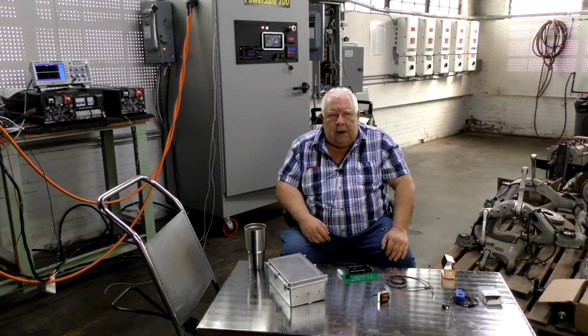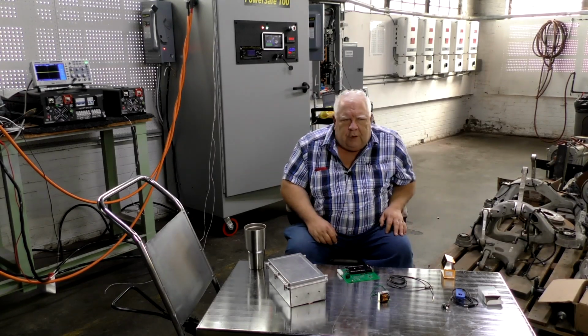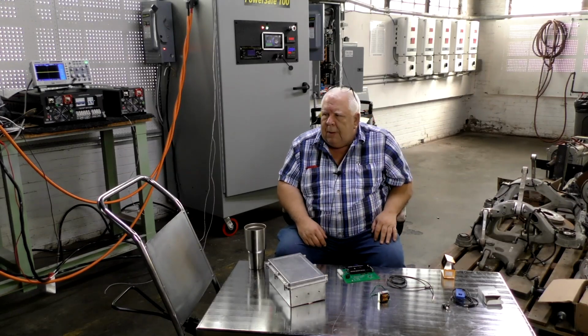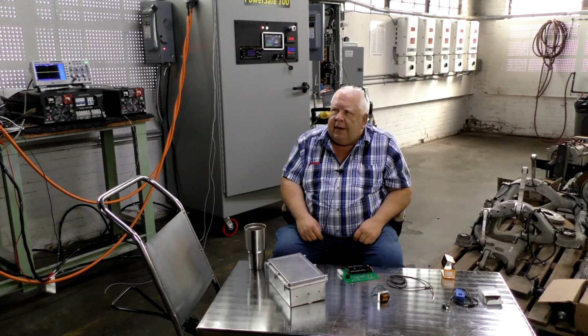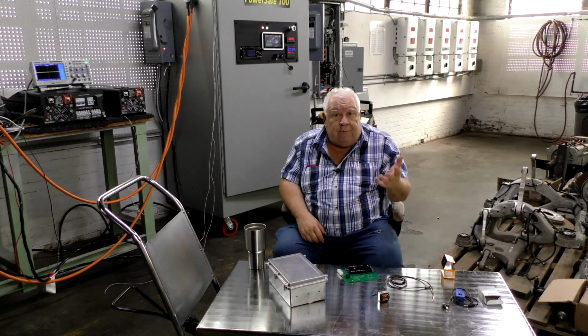Like DC power, if you multiplied your AC current by your AC voltage, you would think AC power. You don't exactly. You get apparent power, and that is simply volt amps. And in fact, they designate that measurement as VA, or volt amps. You'll often see inverters specified as VA instead of watts. That's because it's always a higher value than watts, so it looks like their inverter is bigger.